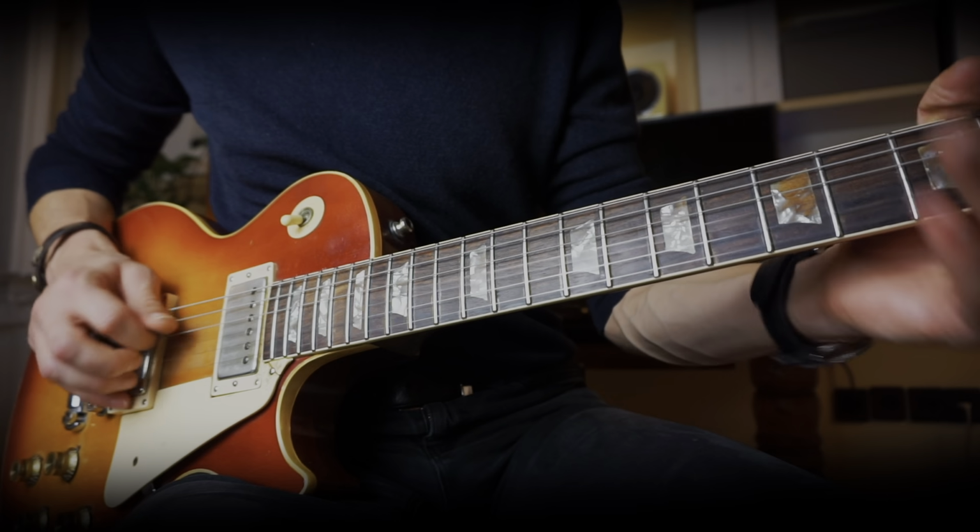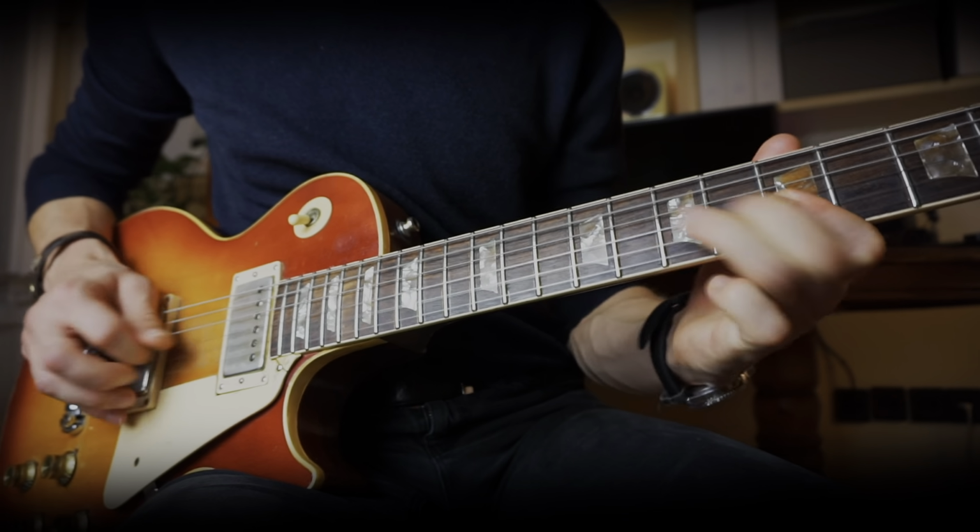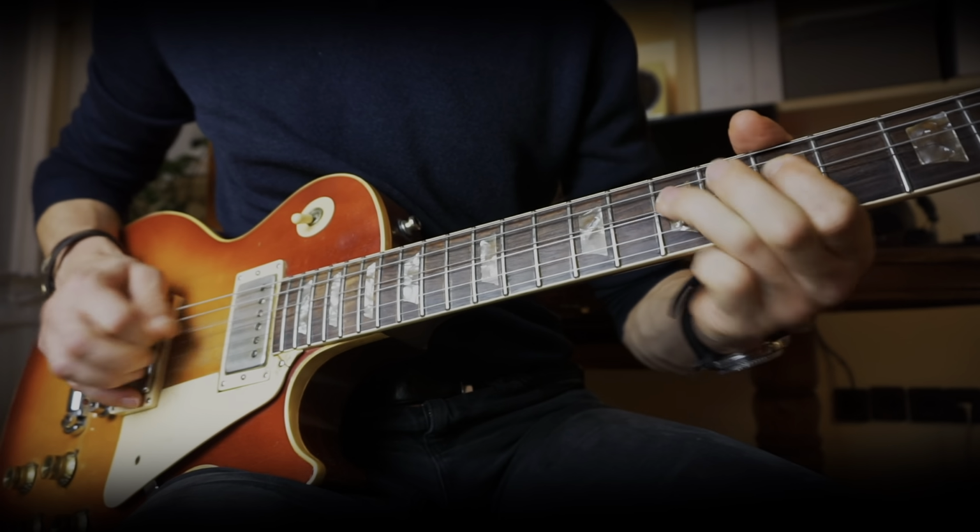So like this, you would still have that sweet, round, full sound, aka the woman tone that Clapton and Santana made famous. But I found that half the value makes it much more usable as a high frequency filter, and it keeps your transients alive. This funny raw resonant voice, I think, is a free byproduct you get with the modification done. And with the modification done, you'll be more likely to use the tone control more to begin with, because it sits in a more musical place in the EQ spectrum.